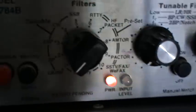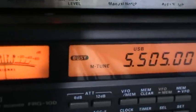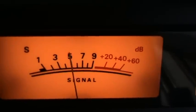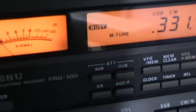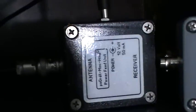I think that's significantly better - more intelligible at similar signal levels. So we'll find a daytime NDB next and test the two power feed units on that. We have TUR in France, which is 223 miles from me, and it's quite good for daytime reception. This is on the old original power feed unit.